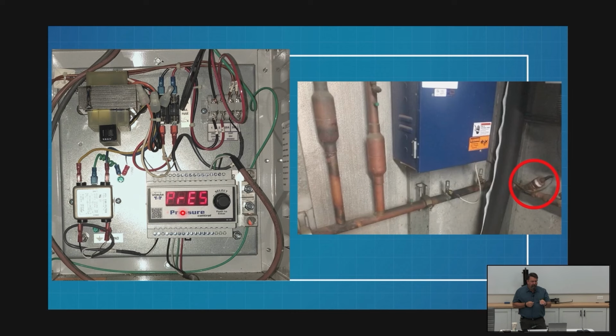So this takes out that problem we were talking about, that if I'm changing this A8 in July, you're going to have to follow this process I'm going to send you to set this valve. It's not an easy process, it's not quick, and it's not 100% accurate. If I set this guy up for 150 pounds, yeah, it'll be 150 pounds, as long as that's what your transducer reads, right? Until I have the traditional problems that I have with all of my electronics. Right, my valve goes to crap, loses its zero, got too many steps programmed in it, whatever.